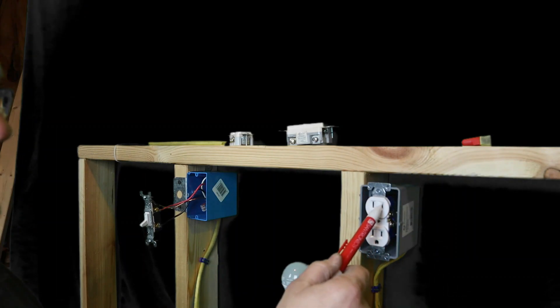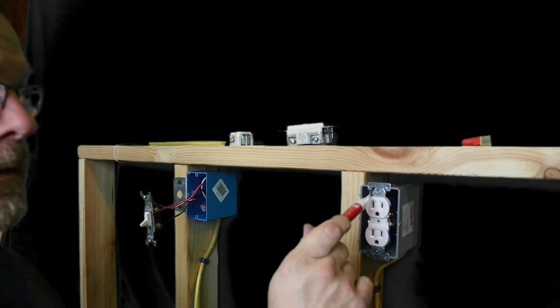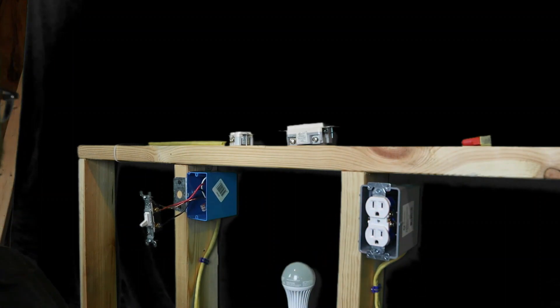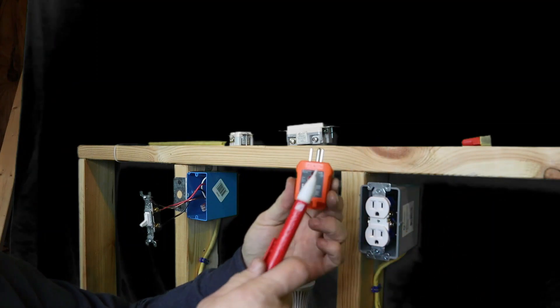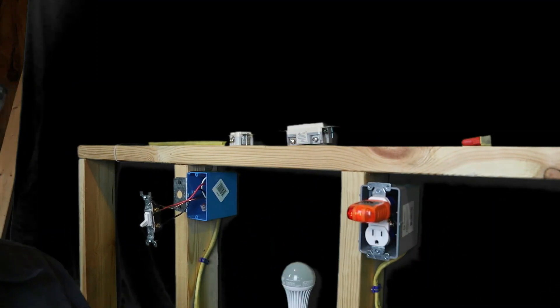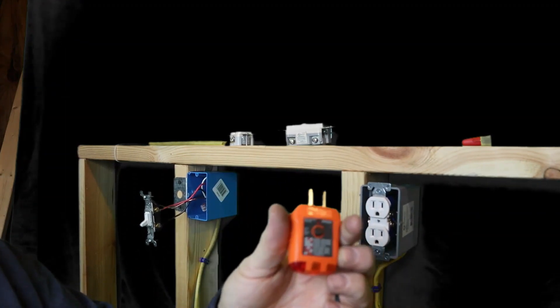This tick tracer is only good for basic testing. When you go to any receptacle in your house, definitely test it — and test here too — because if it is miswired, you want to know. I highly recommend getting a circuit tester. It doesn't take but a second to see that something's messed up, and it could potentially save you from getting shocked. It takes a second to get hurt and a lifetime to get over it.